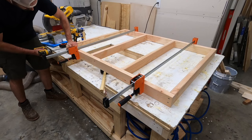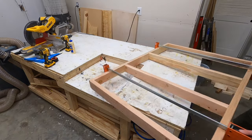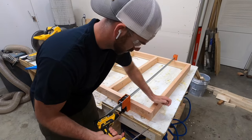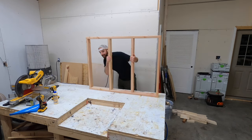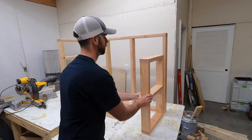These pieces are tacked together using glue and screws. The glue is probably overkill and not necessary, but it won't hurt anything. Because this will be covered up by the tongue and groove boards, it doesn't need to be all that pretty — you just need an inner frame that's sturdy. At this point you should have something that looks like a window frame or a jail cell, depending on how you want to look at it. Next we'll build two sides in similar fashion.